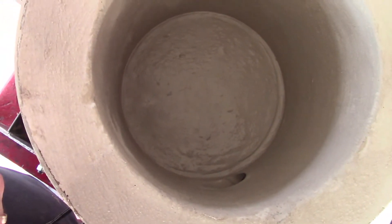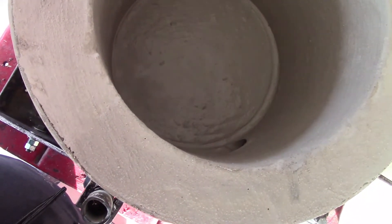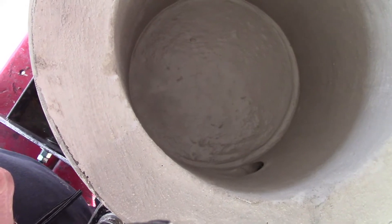This is what it looks like on the inside — it just evens the color out and I wonder if it's going to change color after it heat cures. Anyway guys, I think we've had a good day — we got the mold out of it, cleaned up the outside, got it ready for paint, put the ceramic coating on the inside, and got a cart made for it. Maybe next time we'll be putting the burner in, firing it up, curing the inside with that ceramic coating, and seeing how it all works.